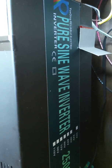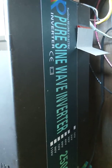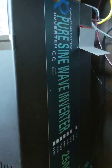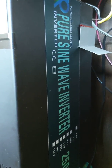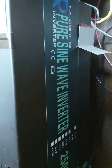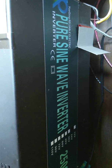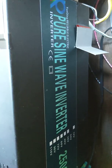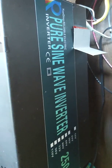People then get confused as to where they will be able to plug their 12-volt appliances in, and that will be an additional connection, actually like the third or fourth connection, to the battery terminals, and you would put a 24 volt DC step-down box to 12. They come in all different sizes. I think the 20-amp version, which would probably suffice for most people's 12-volt usage, was somewhere around $30 to $40. So it's an extra little box.